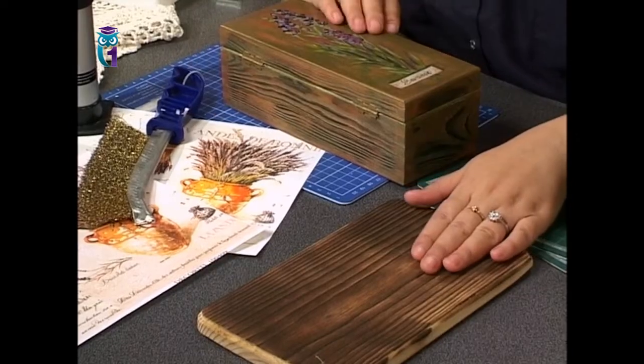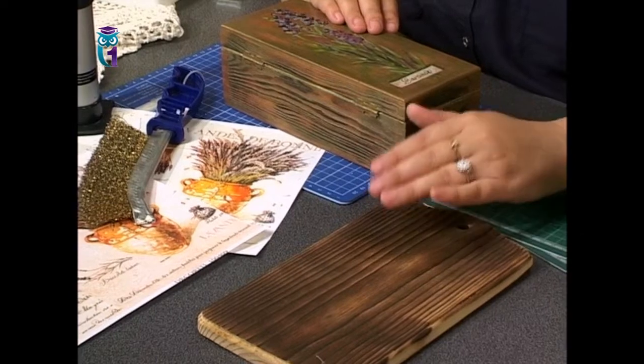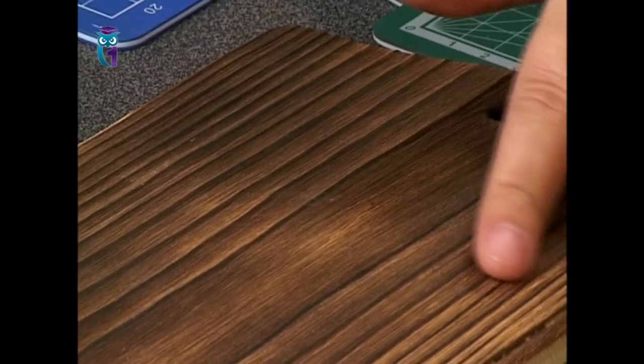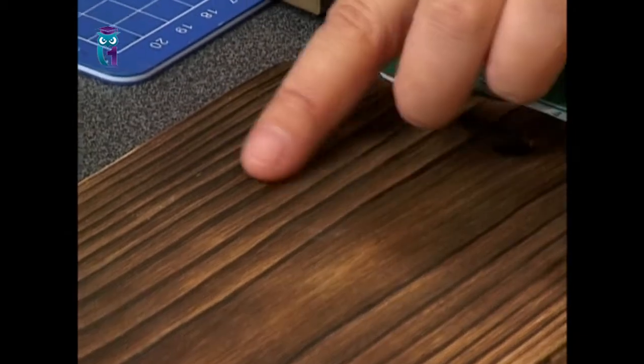So, we begin with the most interesting process in today's work, from preparation of a product from natural wood to brushing. I repeat, brushing is an independent process, which consists in that by means of a steel brush you clean, in other words, brush off the fibers of wood from the surface of a product and get a relief. In other words, a strongly pronounced structure of wood.